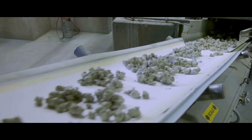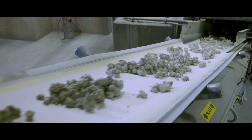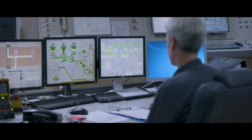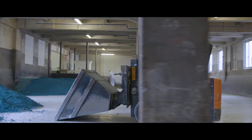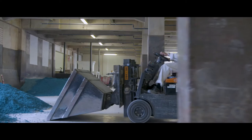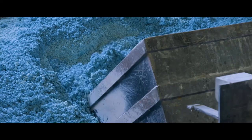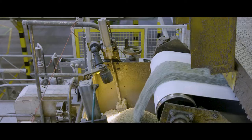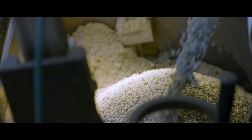The coloured linoleum mixture is now shredded in various stages as it is transported to storage lofts in preparation for the final mixing stage, creating beds of different colours of linoleum granules. One bed produces approximately 15 rolls of linoleum. Every bed has a composition of two to eight colours. The linoleum granules are now ready for their final mixing process.